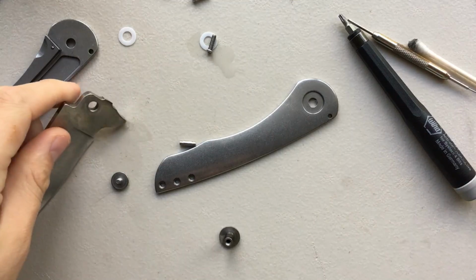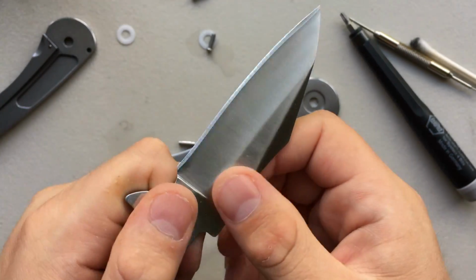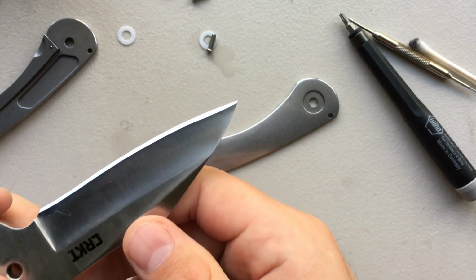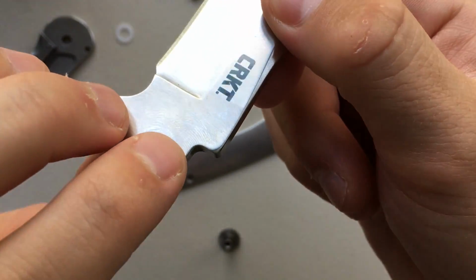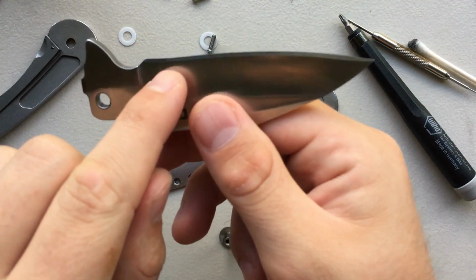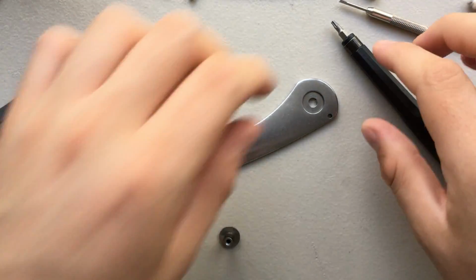Now, pivot's cleaned out, and blade itself is fine. Again, one thing that really strikes me about this knife, and I'll mention it in the full review, is the polishing on this blade, in that it is really over-polished. Like on a watch case that's been polished over and over again, you get this kind of rounding and melting of the corners. It's like the entire thing was heated up a little too much and hit with a buffing wheel. It's fine, but it's just a little interesting. I'm not a huge fan of it, but you can even see in this area here, this top corner has really been buffed away, whereas on this side it's pretty clean. Which makes me think there was literally some guy sitting there at a manual polishing wheel going for like 20 minutes to smooth this off, and that's probably how the blade picked up this weird little recurve there. But anyways, okay, that's all set. This looks good. And that's all the knife there is to clean.